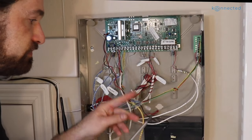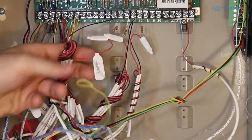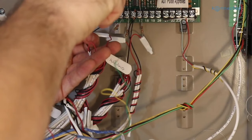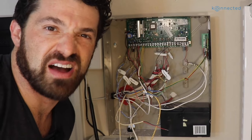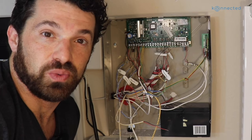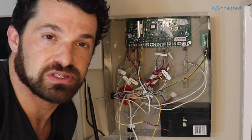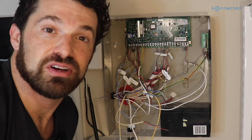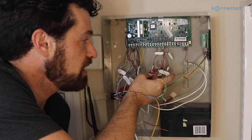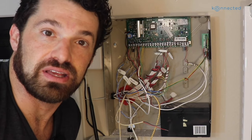This one's already labeled as motion. Now my zone four is a big bundle of wires labeled windows. I'm not sure which window is which at this point, and to be honest, it might not even matter. There might not be as much value in separating out every single window as there is in separating out the front door and the garage door, because it may not be useful to know which particular window is open. As long as you can group those windows in a general area of the house — maybe downstairs windows or living room windows — that might be good enough for your home automation and security use cases.